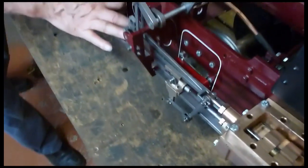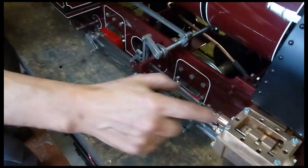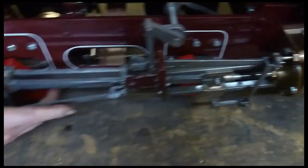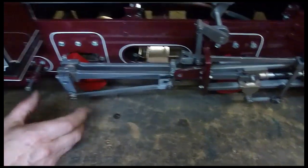As you come around to about there it should close — and it closes. When you get to the back dead center you get the same again but at the other end. So at back dead center that port's just begun to open, then it should be fully open one moment later.